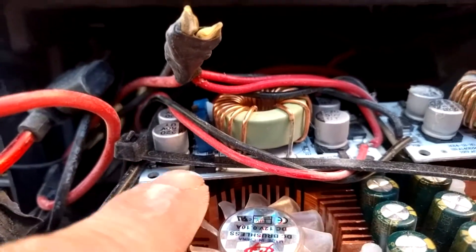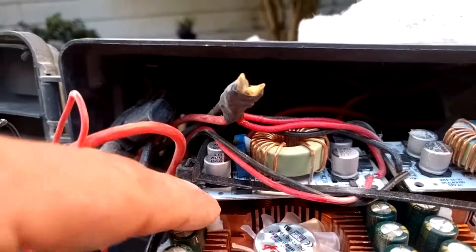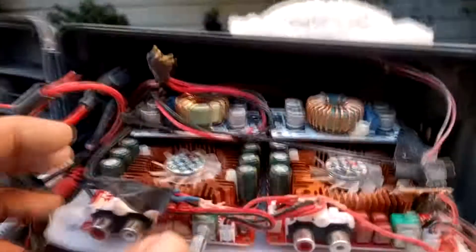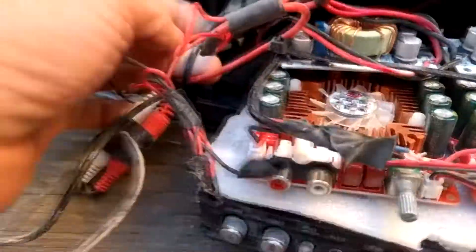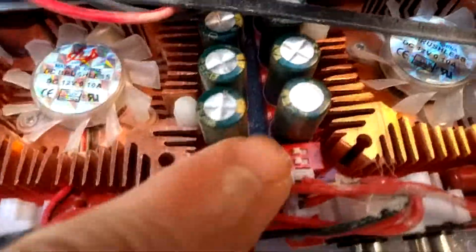For each amp board I've got a 250-watt boost converter — really cheap, aluminum PCB, which is great as a heatsink. I use sticky pads and standoffs between them so nothing is shorting. Both are set to maximum current and 35 volts from whatever input comes in, so 12, 15, or 24 volts — it doesn't care. There's also a 5-volt buck converter doing USB power for charging. The audio inputs come in on JST connectors at maximum gain.